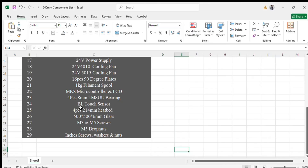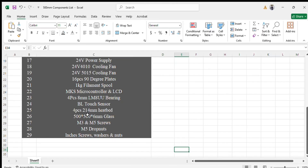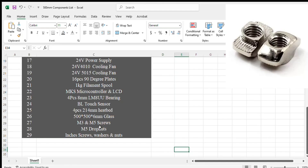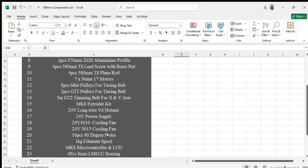Four pieces of 8mm LM8UU bearing. After that, you will use a BLTouch sensor for the Z-axis homing, which is also efficient for auto bed leveling. Four pieces of 214mm heat bed — as a 500mm heat bed is not available here, I used four 214mm heat beds on the aluminium profile and placed a 500x500x6mm thickness glass on them for 3D printing. After that you will require M3 and M5 screws, drop nuts, T-nuts, washers, and nuts. Also in the list I forgot to add: a 5-to-8mm coupler for the NEMA 17 motor to join the lead screw; two end stops; an NTC thermistor for the heat bed; and a Teflon tube for the filament.